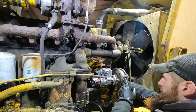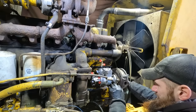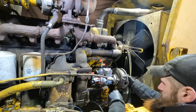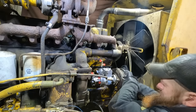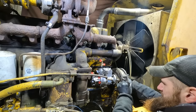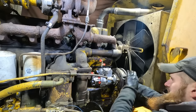And it will literally go kunk all the way in and lock in to the back of the pump, and then I will be able to see the timing mark with the possibility for it to move. So I'm just going one tooth on into the next tooth. And another thing is I can't pull it out all the way to know exactly where the mark is to get myself to that 3 o'clock, because those umbrella seals have to feed through this plate.